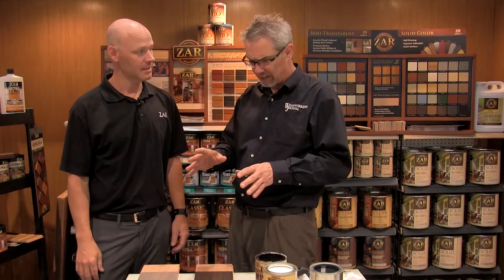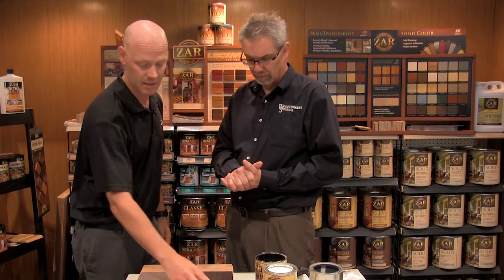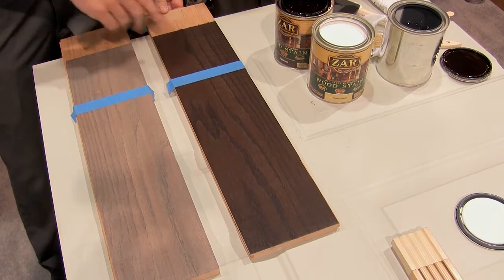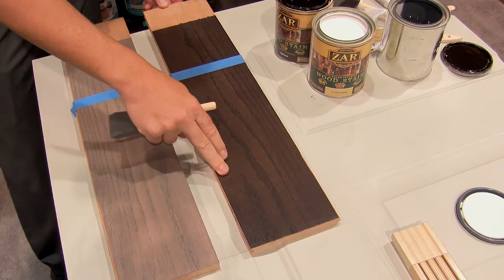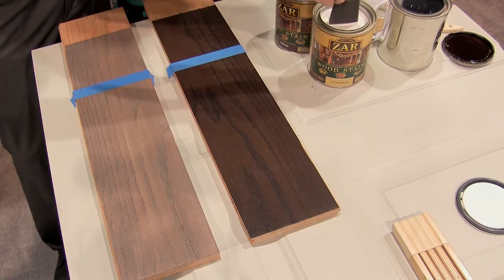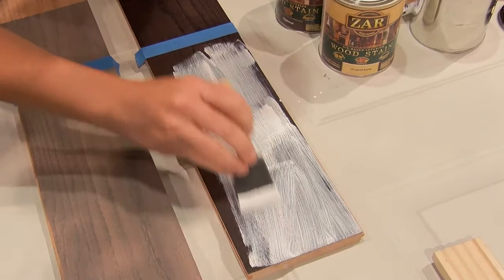Earlier you mentioned that this glazing technique or two-tone coloring is also used on flooring. That's correct. Here we're showing a couple of examples of stained flooring that we're going to glaze — using a lighter color glaze over a dark color stain, and a darker color glaze on top of the lighter color stain. The first thing we need to do is pick the color of the stain. Let's start with this darker panel. It was unfinished, so the first thing we did was stain it dark. Once that was dry, we applied a polyurethane coat and let that dry. Now we're going to actually stain the polyurethane and I'm going to use a white color — staying with the idea of a contrasting color for your glaze. It doesn't matter how you get it on there; just apply it on the whole surface and make sure you rub it into the grain.